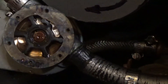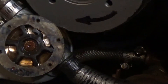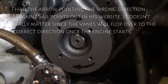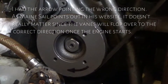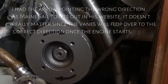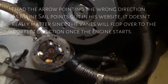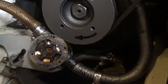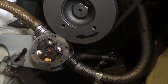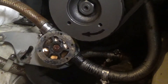Now it's turning around backwards, but I don't know. Here's the crankshaft pulley — it shows that that goes clockwise looking aft. So I have to give this a little thought as to what direction the impeller should be going. But it is going in a clockwise direction, which would be counter-clockwise when it's flipped around backwards the way it is installed.